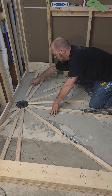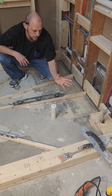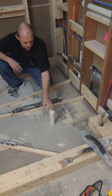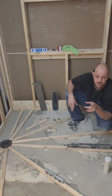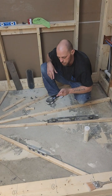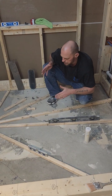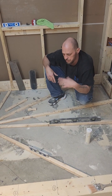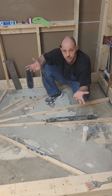Once that is done, it will be time to put our mat down and go over the curb. We had to build a box over here in the corner — this is going to house our three-foot tall, really beautiful faucet. It's going to end up going over for the tub here, and this is going to be the stand-up shower part. So a lot of good stuff coming. We've got our levels sitting here, everything is pitched to perfection. Again, two different pours — this will be the first one. We will put the mat down, waterproof everything, get our backer board set with the mat running up behind it, and then we will move on to our second and final pitch before we go to the tile installation. Hope this helps you at home in your journey — this is just our way of building our shower bed.